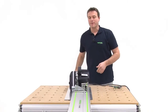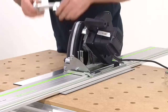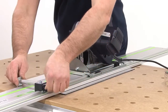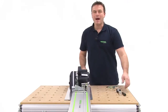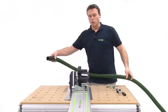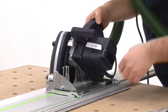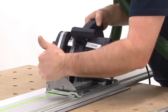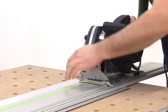When dealing with large size panel materials, I can find the right position by using additional equipment installed in the guide rail. This machine must be connected to a 36 mm mobile extractor hose — this is the optimum way of extracting any plastic and aluminum chippings. In the front section of the system, we have the so-called adjustable stops. I can preset these to the feeler roller depth to prevent the device from penetrating the material too deeply at the edges when I start cutting.